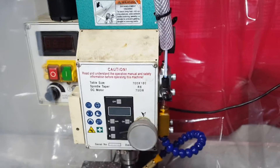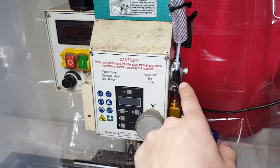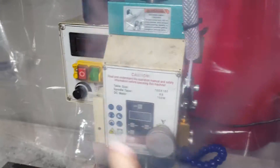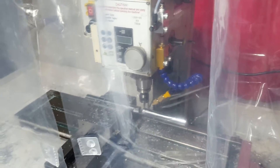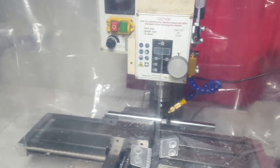I made a mixing block with some Legris fittings and a needle valve. Coolant comes through here, air through here — real fine, I think a 0.04-inch hole, and then a 0.08 or 0.09-inch through-hole. It works perfectly. I have it set so about every eight to ten seconds it sends a pulse of coolant — enough to keep my bit cool. I'm cutting at half what G-Wizard actually recommends, so I should have really no problems.